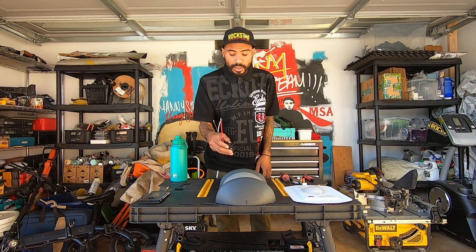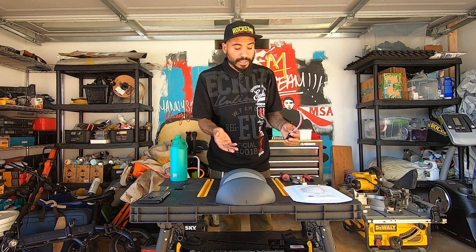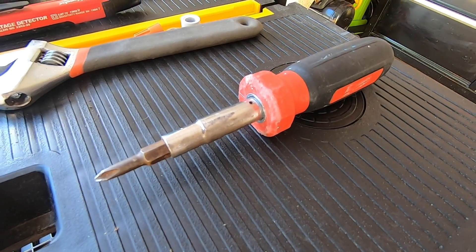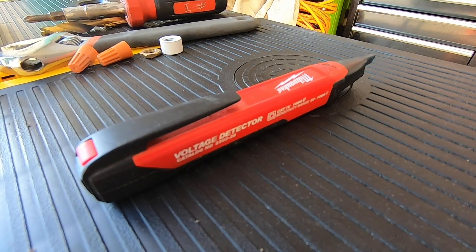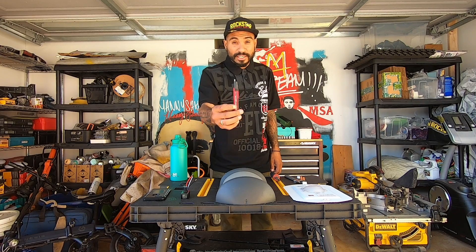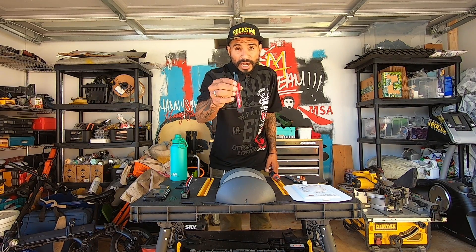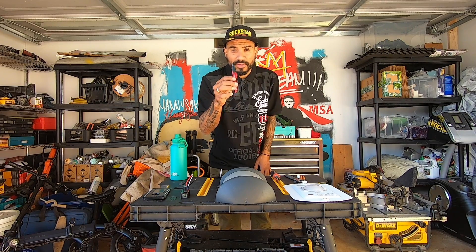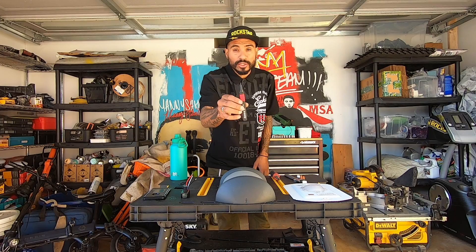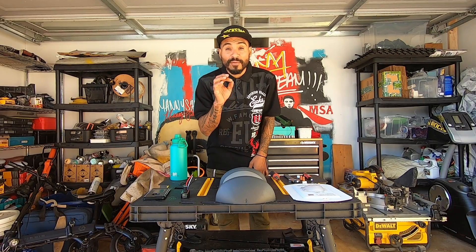You can find the link to this sensor or something similar in the description below. It's pretty easy to install — I've never done this before, but I wanted to show you guys: if I can do it, so can you. You're going to need a couple of tools: a screwdriver, an adjustable wrench, and one of the most important things when working with voltage in your house — a voltage detector. That way you don't get electrocuted. It happened to me before, so I had to buy one of these. These things are a lifesaver. I'll put a link in the description below. You turn it on, find the hot wire, and put it close to the tip — if it doesn't go off and doesn't make a noise, there is no electricity. Make sure you buy one of these if you're working with voltage.